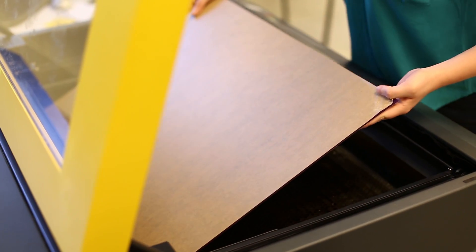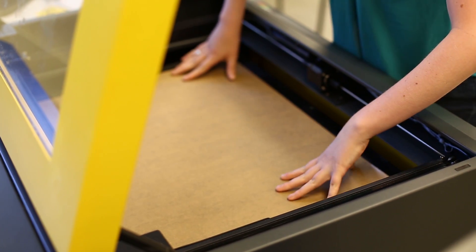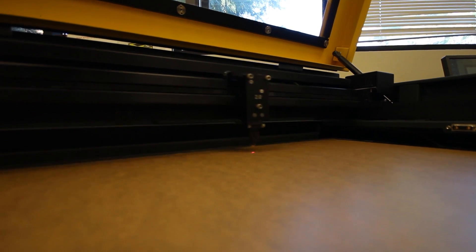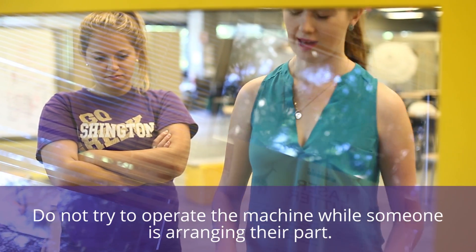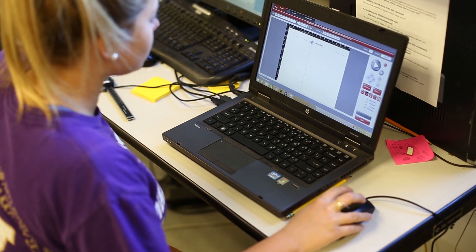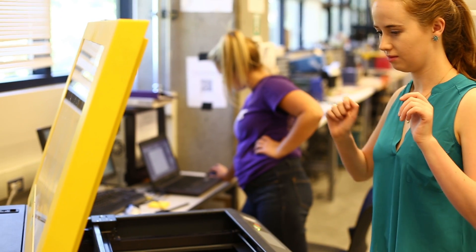When the laser is open and a part is being located, ensure there is nothing in the way of the laser's gantry while a jog is being performed. While the laser is moving, the only thing that should be in the laser cutter is the piece to be cut. If someone is arranging a part inside the laser cutter, do not try to operate the machine at the same time, or else you may harm the person arranging the material and the laser cutter.